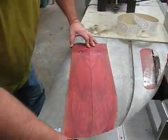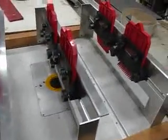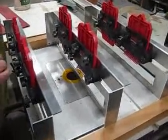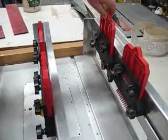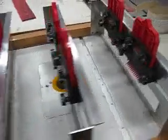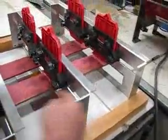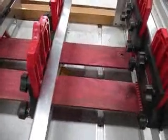What you're viewing here is the newest woodworking tool on the market right now. It's called the Paraline clamping system. The name is derived from the Paraline featherboard that Jessam developed, and we're going to use this method to secure our bookmatch. So what I'm going to do is slide the two pieces through the clamp, right through the jaws here. Now I have them set about 10 inches apart, you can see, and wherever you position them on your sidewall would be fine.